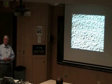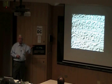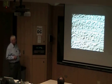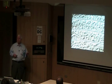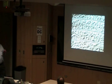And there's a micrograph of the actual picture. That's what they call an Epi-Nomarski micrograph. And what's interesting about this is the numbers, because not only did we have to put the structure over the entire surface of each of those tilted nested facets, but the structure itself is shallow. It's only half a wavelength deep, and that has to be controlled. It has to be controlled because if you make it any shallower than that, it tends to go away.